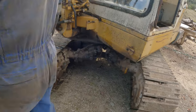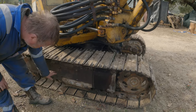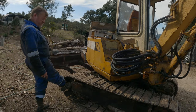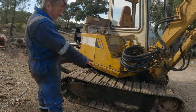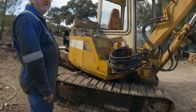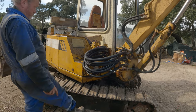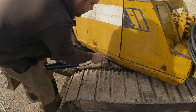For the tracks — on this machine and on older machines, if you take the little plate off there's a big heavy-duty bolt in there. As you screw that it pushes the idler out to tighten the tracks. More modern machines will have a grease nipple in there and you simply pump grease into a little cylinder and that pushes the idler out. So you either have a screw system or a grease-cylinder system — your machine will have one or the other on either side for the tracks.